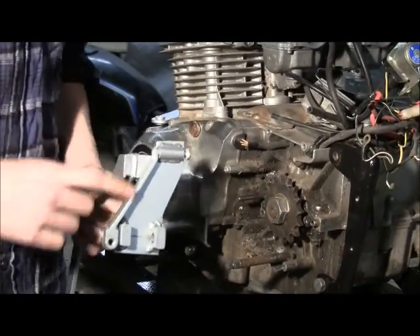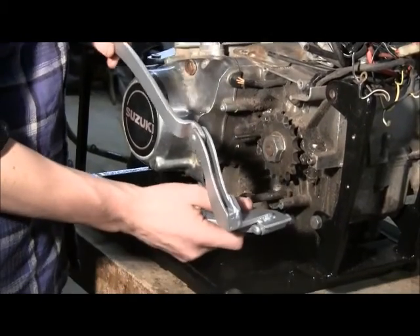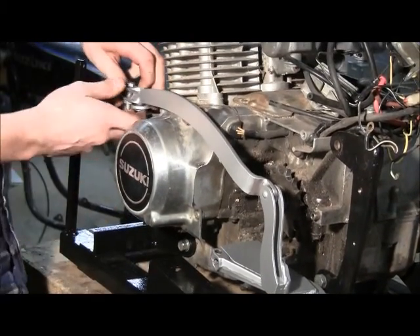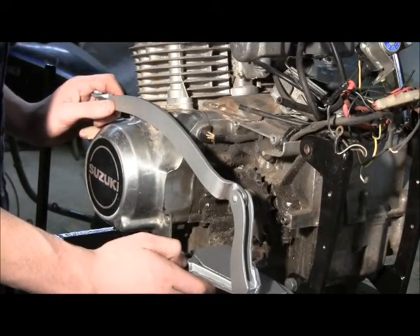Here was the existing foot pedal to shift the gears. We turned it inside out so we can place it on backwards, so all the linkage goes over the top of the drive shaft that was previously in the way. Then everything connects up front so we can shift gears from the front. Now we'll put the whole assembly together.